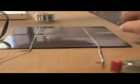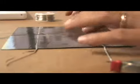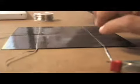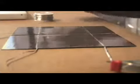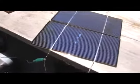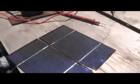So we're going to go outside and we're going to see if this produces 1 volt real quick, because you want to test these as you go along. The time to replace a bad cell is now versus once you're completely done with your project. Now the way that you want to test these is you attach your negative lead to the front, which is this tabbing wire here, and then you can touch pretty much anywhere on the back.